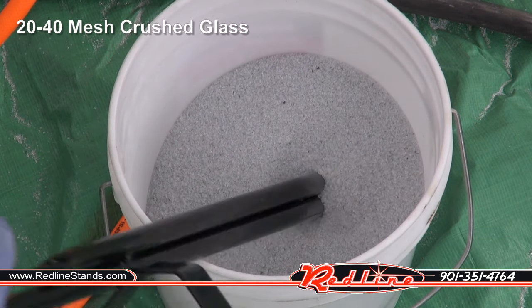All right, so the finer garnet, I was just absolutely thrilled with the way that it removed paint from here. Left a super nice smooth finish. It pulled the paint off just way faster than anything so far. In terms of powder coating removal, it definitely did the poorest job of anything because you really need something coarse for powder coating. As far as rust removal, to be honest with you, even though it maybe wasn't necessarily the fastest thing, I find it to leave the best finish. It does a better job of getting down in between all the tiny little pores versus the more coarse stuff that we've tried out so far. The fine garnet really went to work in all those little bitty locations.